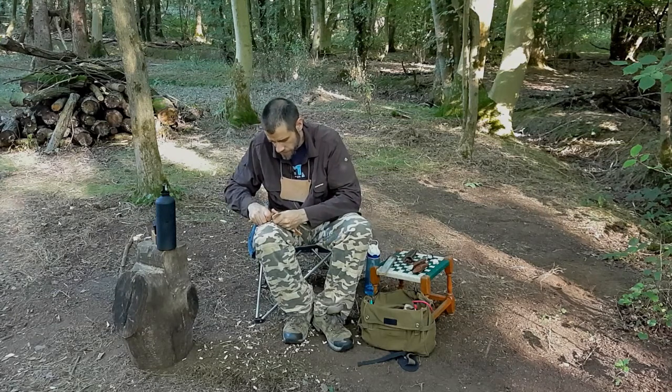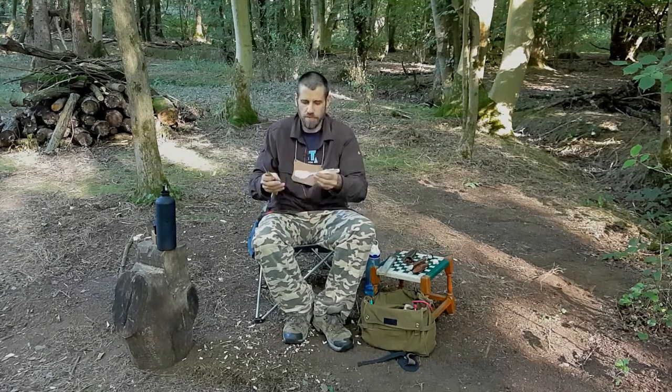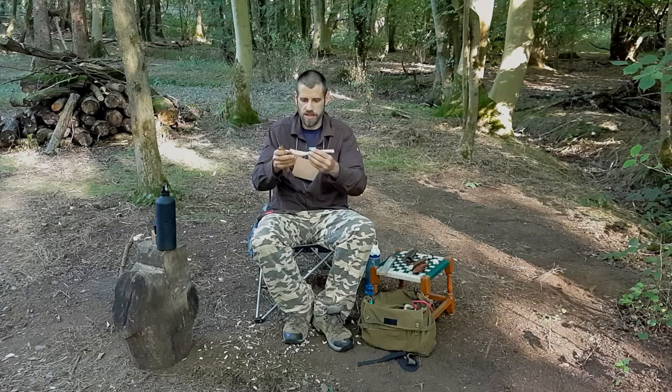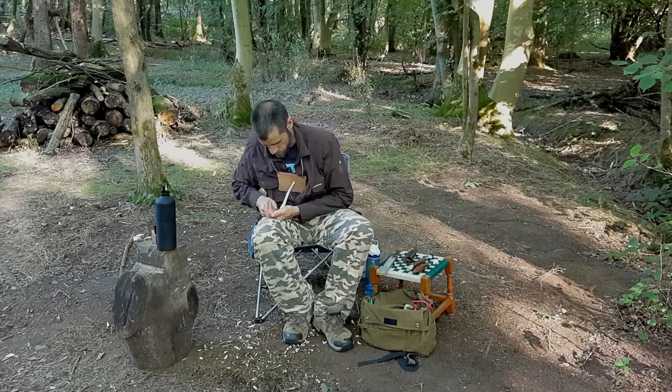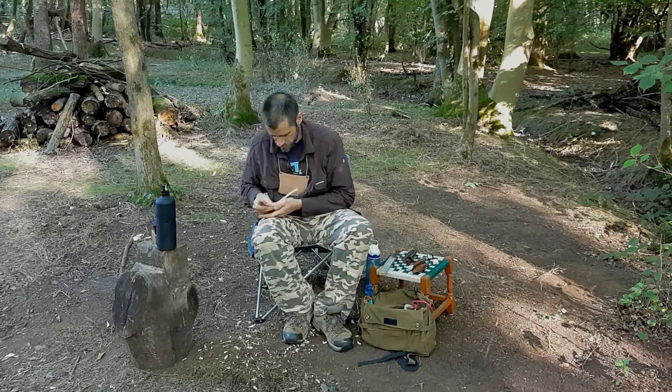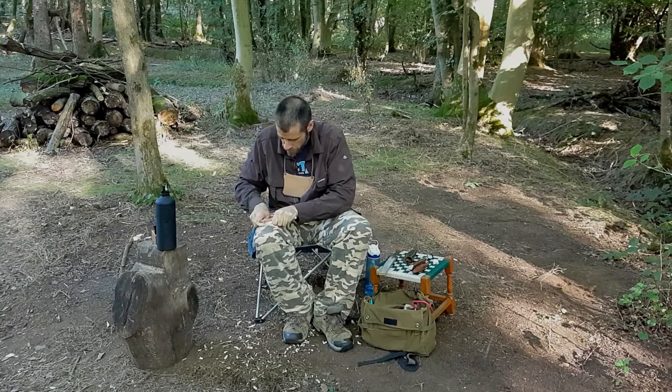Feel and listen to what's happening. Don't, at this stage, obviously overdo it — dig a big lump out that we can't put back. Now I'm just going to come around on the top here, trim up the top face of this rim and blend it in from the shoulders. We need to come down quite a bit here to make this comfortable, and blend this in a bit further back. I always like to establish the right curve from one side, starting on this side here, because I can do that working across the bowl with the tip of the blade and turn nice and tight there.